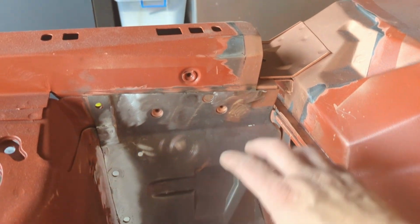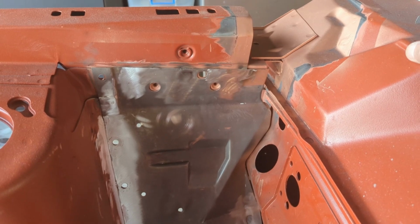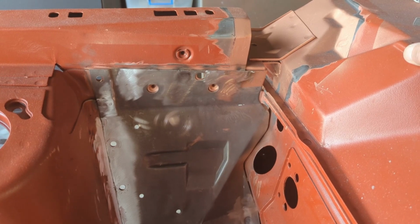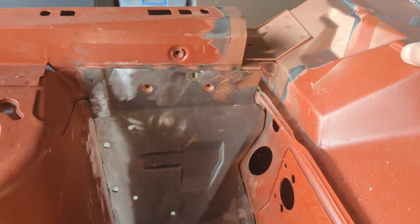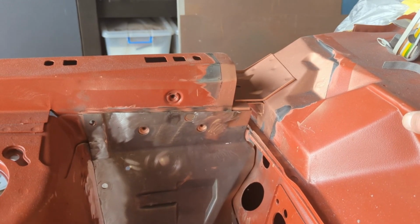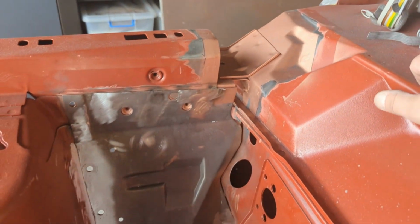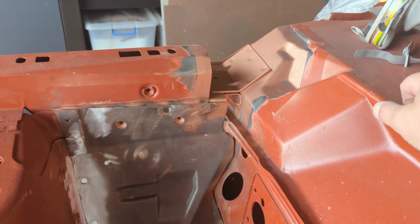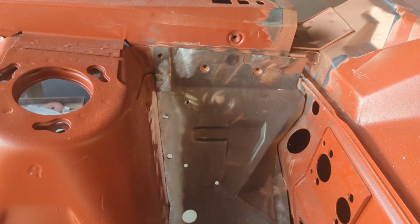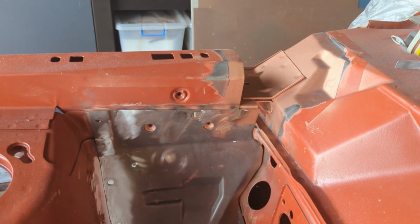So what we're up to now is getting the top piece welded on. As you saw before, I've started to do the preparation work on it, which first up is just neutralising some of the surface rust on the flanges that would have mated up to the body here. And once that's done, I'll give it a coat of copper weld through primer and then position it up and start welding it. After that's welded in, of course, just clean up the welds that are left, and then sand this up with 80 grit, clean it all up and get it in epoxy primer.